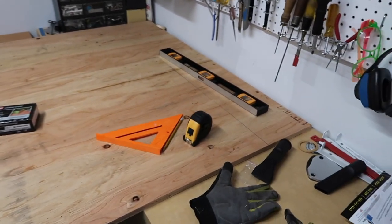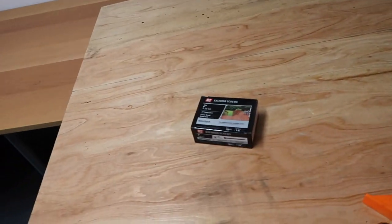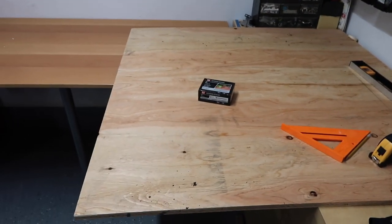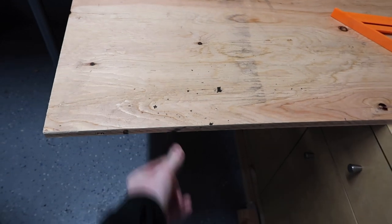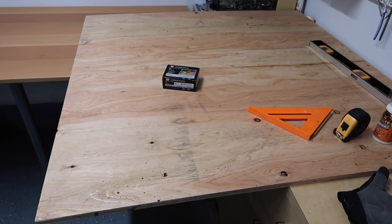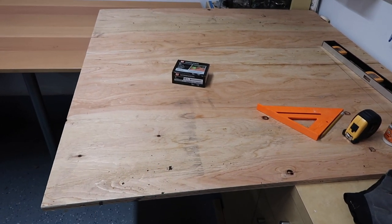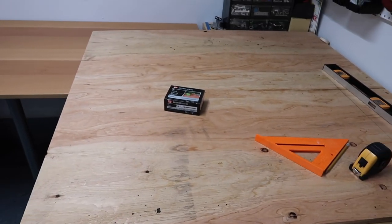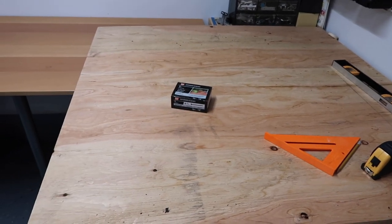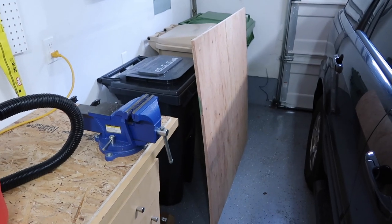All right, well, I got some supplies here. So we can go ahead and start off. First of all, you're going to need a 4 by 8 foot sheet of plywood. This is 3/4 inch. These plans don't have any type of frame or bracing in the box. It's all just plywood. And so you wanna get the thicker plywood for that. At Home Depot or wherever you buy it from, they do cuts for free just to make it easy to transport. So this is a 4x4 section, and then over here I have another 4x4 section.